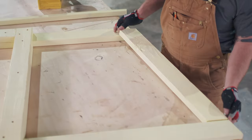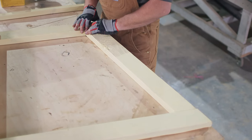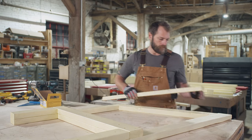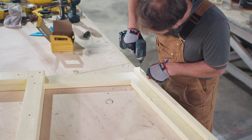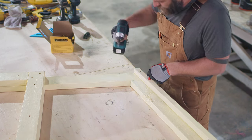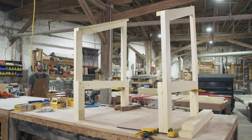Place the 38 and 5/8 inch two by four with angled ends at the top of the frame. On the inside, between the boards, place a 31 inch piece also with angled ends. Secure with two and a half inch screws. Create a mirror image for the other side.